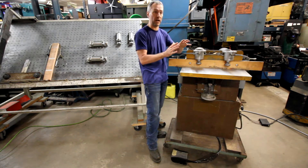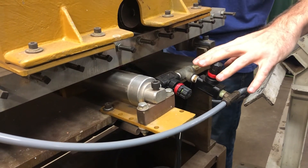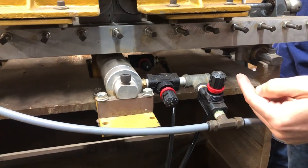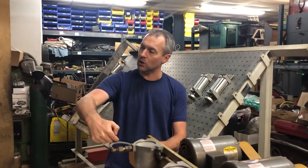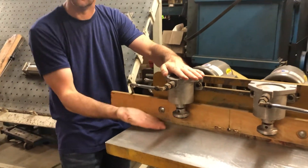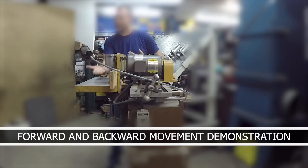When the drill bits are still in the wood, that can really mess with the holes. There are three flow control valves on the back — these two and one buried up in there — and each one controls a different function. This one controls the clamps, but it's not controlling the air going to the clamps; it controls the exhaust. The clamps pop down, then it slows the air going out, so when the air is exhausted it goes through a flow control valve in reverse fashion, which is what keeps the clamps so slow to come up.